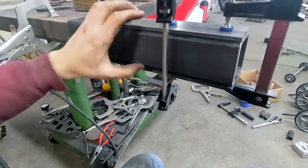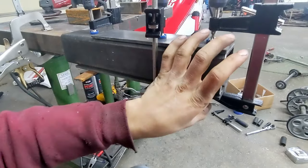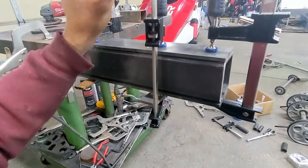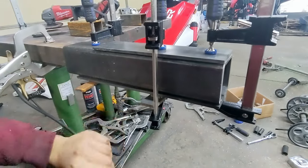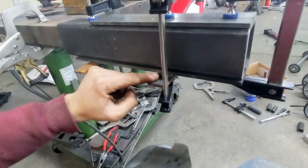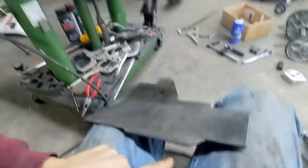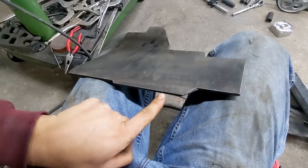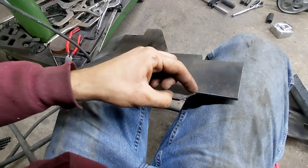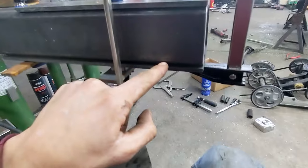Put about three pieces of wire under the bottom piece so that when we weld it and take it apart there's enough clearance for it to slide in. Then put three under the bottom piece, put the top piece on, and put clamps just finger tight — just barely tight enough that the clamps stay on. Then here you want to put a half inch shim under the bottom plate and something for the side plate to set on, because this is three quarters of an inch lower and we want this flush with the bottom of the tube.